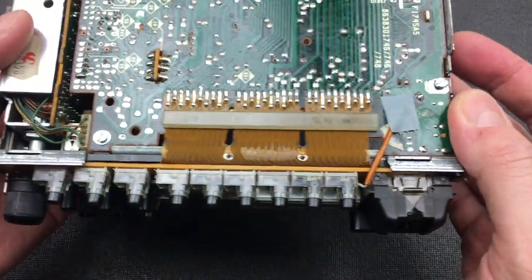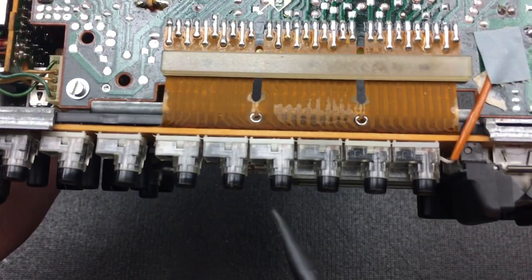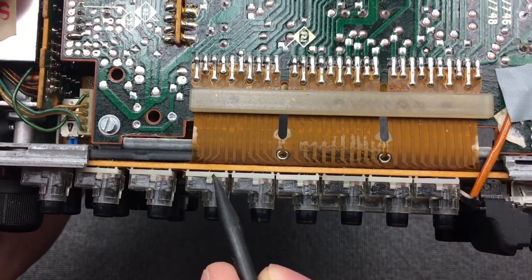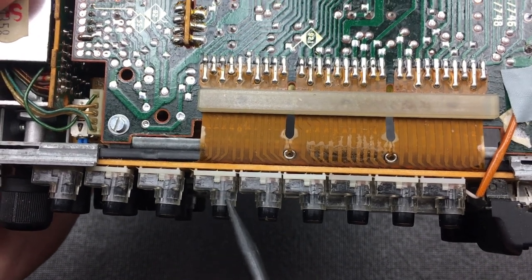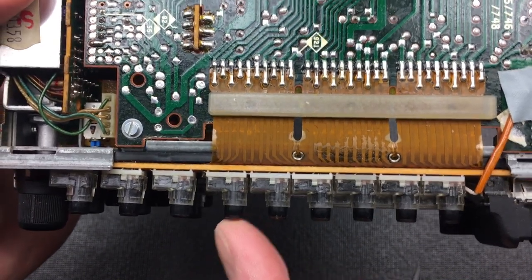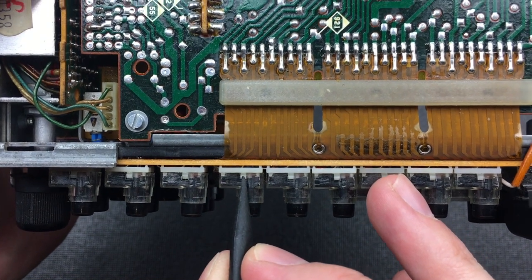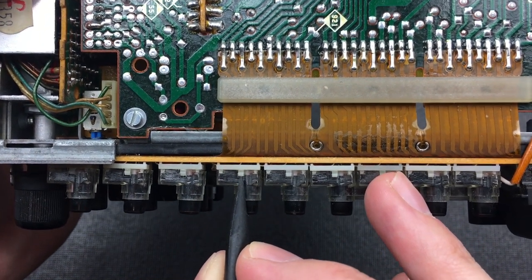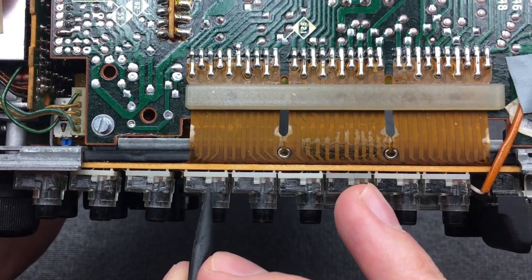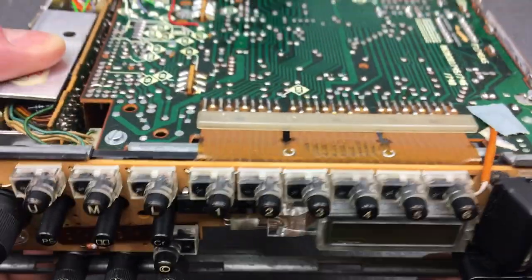If you look a bit more closely at these buttons, you'll see over here that they're basically connected in two ways. So here is a white plastic frame that's actually connected to the board, and there's transparent plastic in the front that's just clicked into that, which is kind of a housing that holds the black button, and the black button moves with a spring inside there. And see over here that on the top and on the bottom there's a small little clip on the white plastic that will stay behind. That's basically holding a little piece, so we have to just press on these clips to be able to remove this transparent piece.